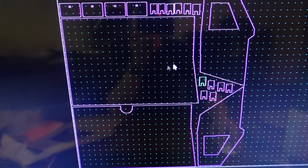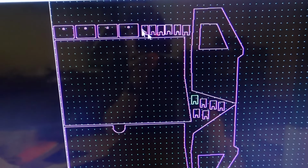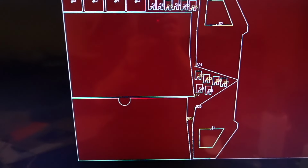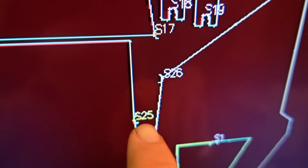I adjusted the passenger side piece to match, and then we got some of the mounting tabs that we will be using. Drew those up quick. Hopefully those work out the way I'm thinking. And here's what that program looks like after we put it in the post-processor to account for the offsets on the plasma torch cutting and with our start points.